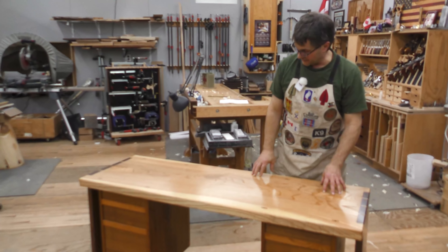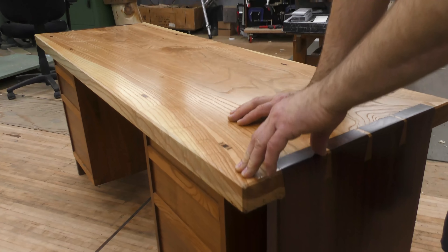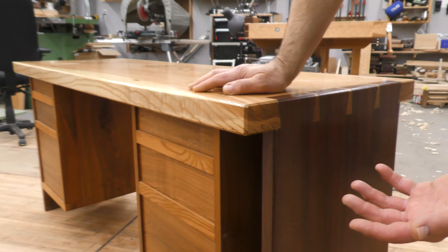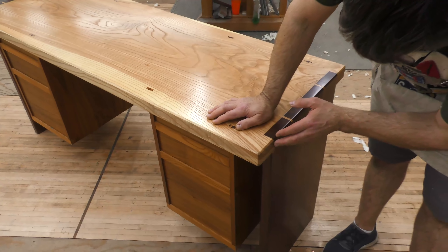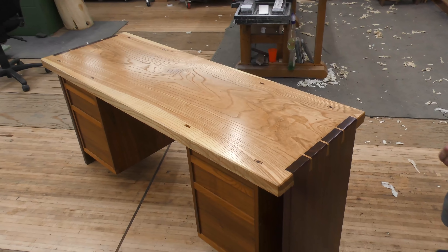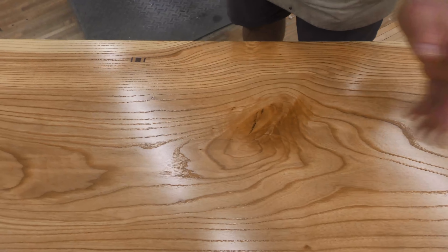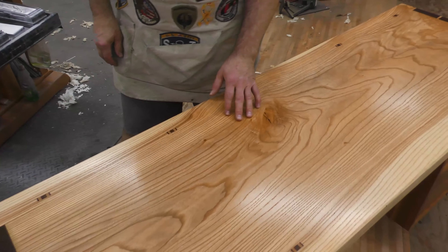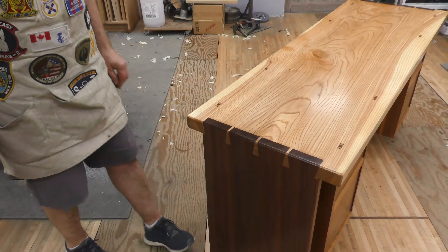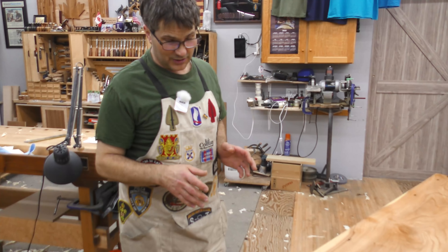When I was working around this piece of ash, there were some flaws. Being air dried rather than kiln dried, it was infested with powder post beetles. They go in, make little round holes, and literally turn the wood into powder — and they were still alive. After I finished the desk, I would find little pyramids of powder underneath. I had to cut off as much as I could, which limited the width. There were also some checks near a knot in the middle, so I had to fill that with epoxy. If you can't eliminate it, rather than try to disguise it, you just highlight it. The dovetail would hold the cracks together anyway. Next, I want to tell you about the accident that darn near destroyed it — but maybe because of the construction, I actually have this piece today.